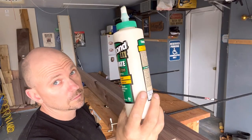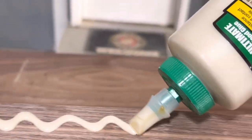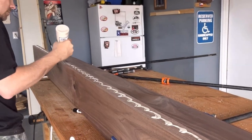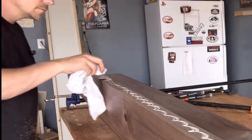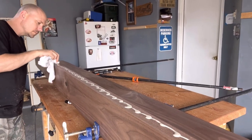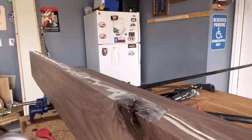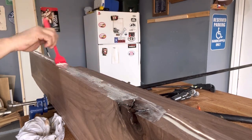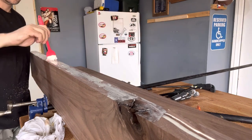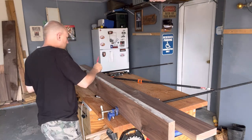I'm going to use Titebond 3 for this project — mainly I stick to Titebond 3 on projects that are going to be exposed to water, but it's a really good glue so I'm using it here. This wood has some really nice knots, and anytime wood has knot holes I like to use those as accents in my work. Here I am removing any glue around them because later on I'm going to fill those with epoxy and I didn't want glue to spill into the knot hole and make it very difficult to get out.